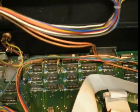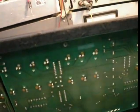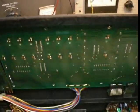CEM3372s and the dual VCO CEM3374 chip over here. See them in this line, right over there anyway. They go under the keyboard, and so there's six of those total. But that's kind of the insides of that, and there's just multiplexer chips on the front panel pretty much, I guess. And so those select the data sliders, 10 kilopots that are programming everything, including the volume control. It has a multi-purpose volume control on it. Well, that's kind of the Chroma Polaris inside, and that gives you a clue how we do these.